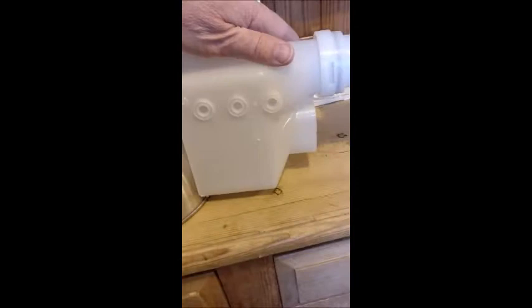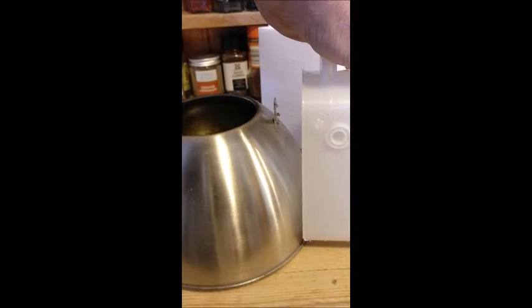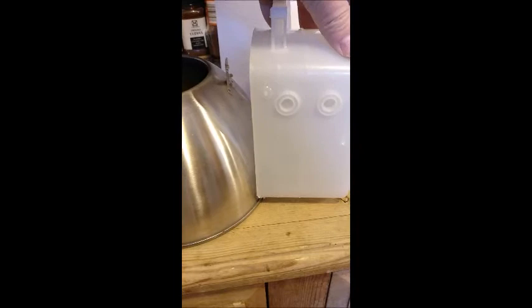And these holes on the side, they're actually for a little plastic clip. One is blocked and two are open. That little plastic clip lets you alter the volume of the siphon, so you can set a lavatory system for a larger flush or a slightly smaller flush, or change the water level in the system. But don't they look just like portholes?